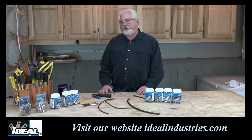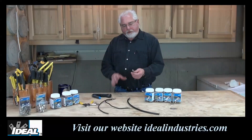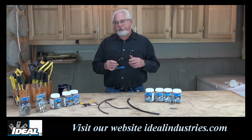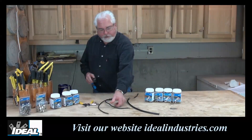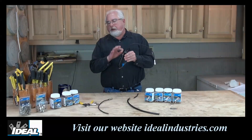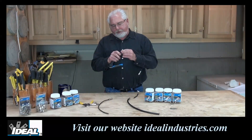Here I have several different types of coax and coax connectors that I'm going to compress using the tool. I'll start with a piece of RG6 with an F connector on the end — it easily loads into the tool and rests up against that first compression level and can easily be compressed. Now moving over to an RCA on a piece of RG6 — it loads in the tool exactly the same way, rests against that first compression level, and can easily be compressed as well.